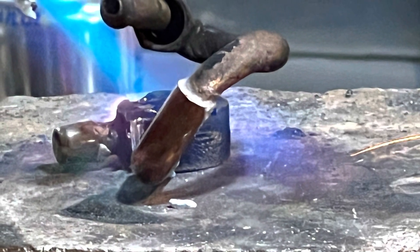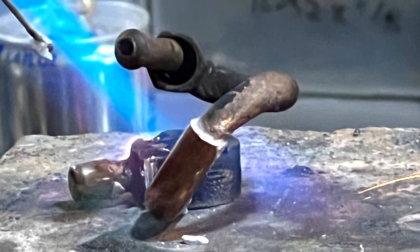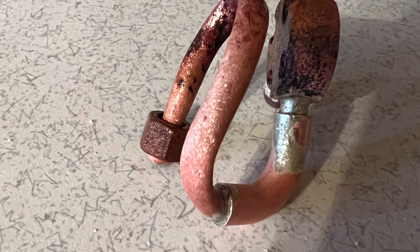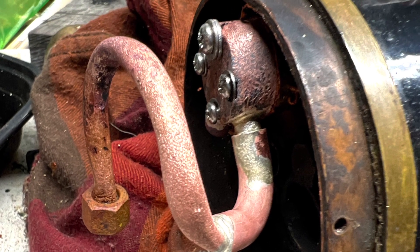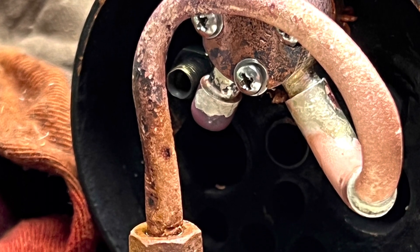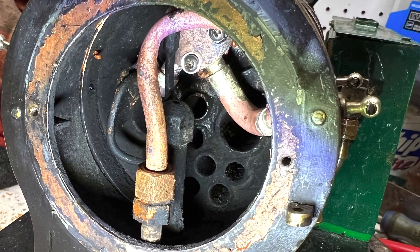Not knowing how to silver solder very well, I deferred that to another live steamer, Jay Monty, who was nice enough to help me. While I did that I overlooked his collection of locomotives — it was quite a nice collection and he has a very nice shop. After a pickle bath in vinegar overnight to clean up the scale on the piece, I reinstalled it and it seemed to work very well. Losing the super heater you lose a little bit of efficiency, but this isn't that big an engine and it eliminates a failure point inside the engine. With that, the project started going in the right direction — things started getting reassembled rather than taken apart.